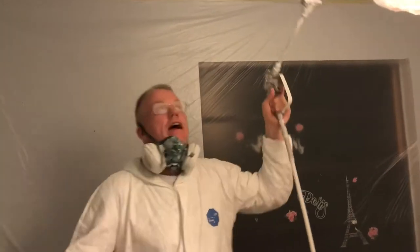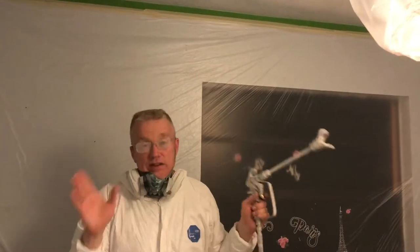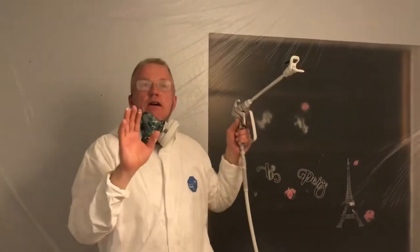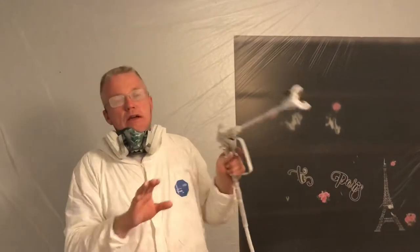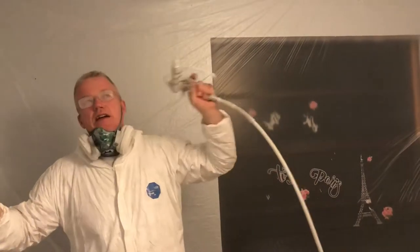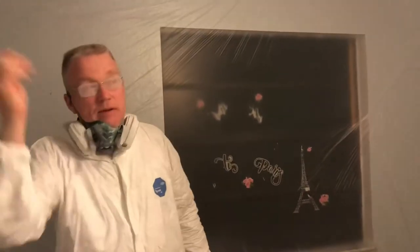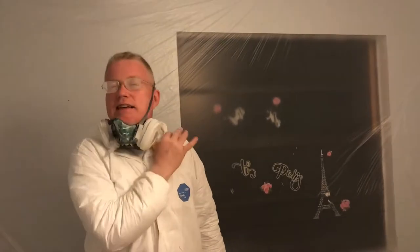Because above the fan will already be painted. You don't want to be spraying and then come to your ceiling fan and be going like this — you will see that when you're done. So once again, start around the obstacles. You want to go up and just hit it and get the paint on the ceiling first. Then when you come around with your last coat, you're going to integrate what you've painted already above the fan, and you won't notice that the ceiling fan has more paint above it. You understand that?